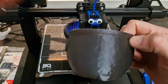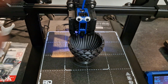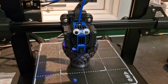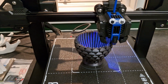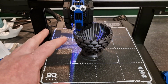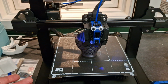So again, that's another thing that'll hold you back with speed printing, is the ability to have high flow, high temperature nozzles. Now this is a relatively stock style system, so it's not designed for extreme high flow and high temperatures. Of course it's upgradable, so if you want to, that can be done in the future. So pretty standard setup when it comes to printers, where you're not going to have a bed slinger to do speed printing.